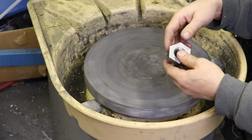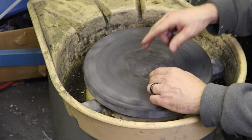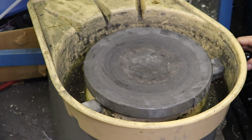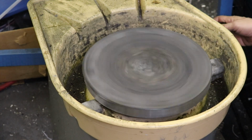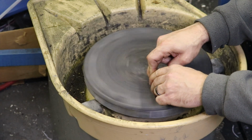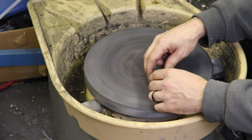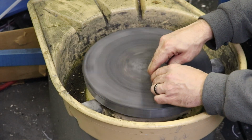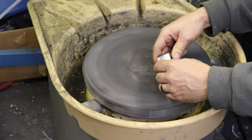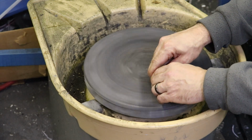So a nice trick for a lapping table or a welding table or any kind of rotary axis is a potter's wheel. You can adjust the speed very accurately if you're welding a round part, or you can go reasonably fast if you're cutting off material. This is just an aluminum platen that's turned very flat, and then I just stick on these adhesive-backed 18-inch sanding wheels. You can get real precise, clean deburring and lapping. It doesn't take off a lot of material, but it's more of a finishing tool. But yeah, a potter's wheel at an art supply place is like $500.